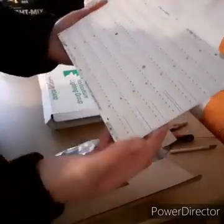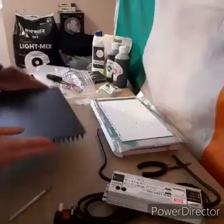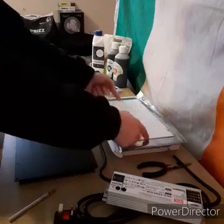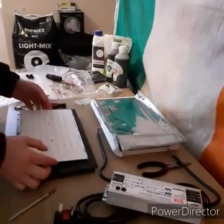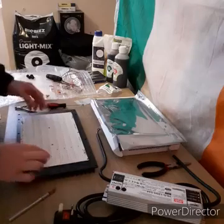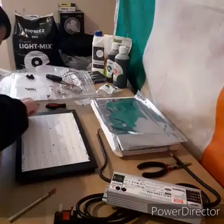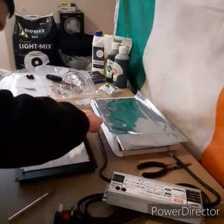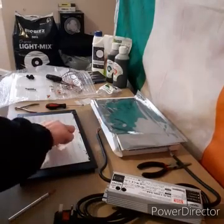The first thing to do is to fit the QB288 boards to the black anodized heatsink, which is simple enough. You just line up the QB288 board to the eight pre-drilled holes on the heatsink, then put in the eight screws by hand and tighten them up with a Phillips head screwdriver — not too tight, so as not to damage the board, but make everything snug and secure.